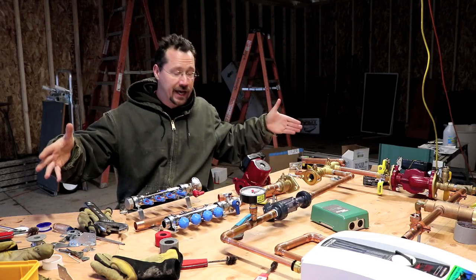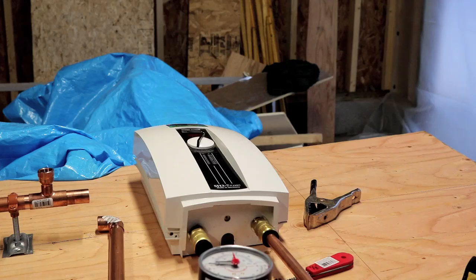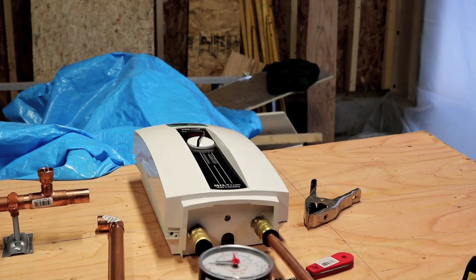So let's take a look at the parts I've got here so far. That right there is the boiler — it's 7,000 watt, 30 amp, 240 volt, and it uses half-inch pipe connections in and out. It's flow activated, so you need a pump to pump the antifreeze-water mix through there, and that will activate it based on the temperature setting you've got. I bought this used for $300 — it's $500 new at the store.